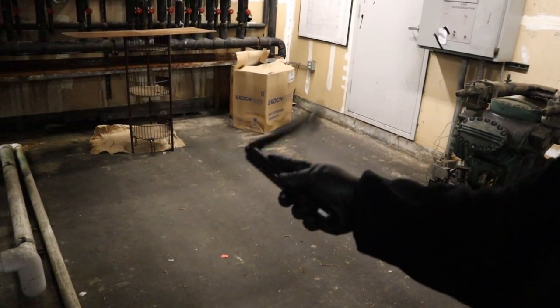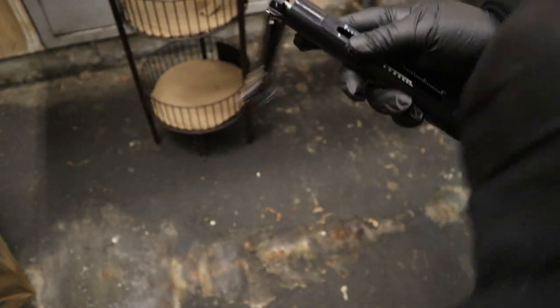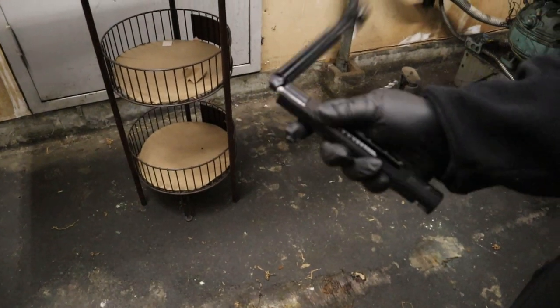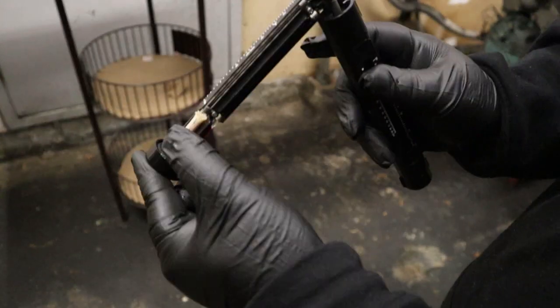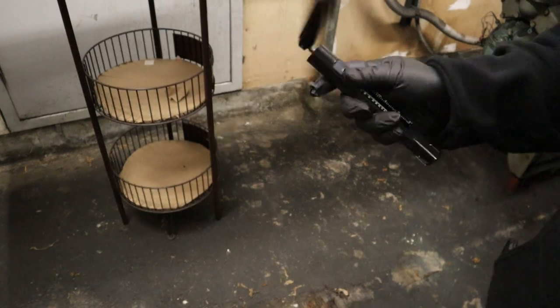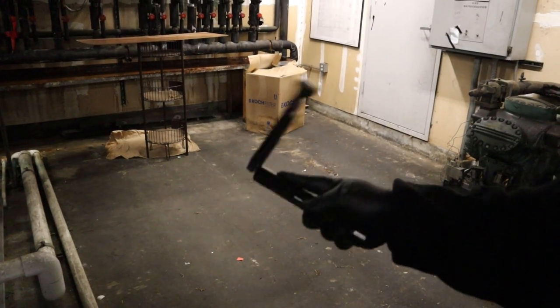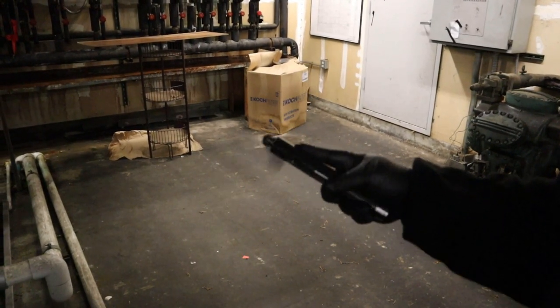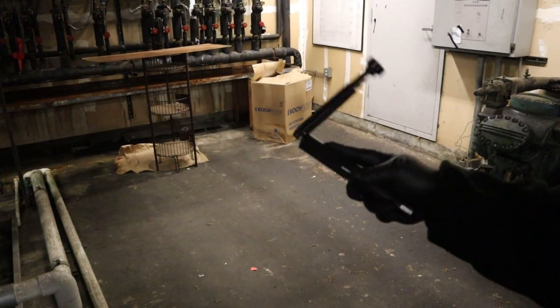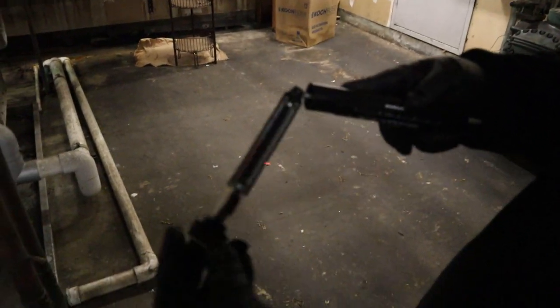I do this about two to five minutes in the machine room. One thing I forgot to mention: when you start slinging, you want to sling toward the wick so the air hits it properly and not against the plastic back. Spin it toward the wick. I usually do it two to five minutes and multiple times to make sure I get the same readings, since they can be a little off. Once I get two consecutive matching numbers, I'm good.